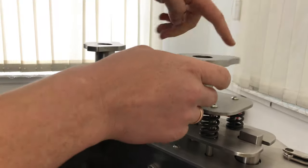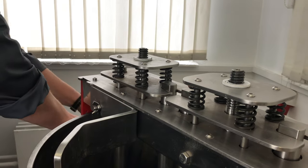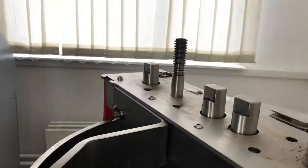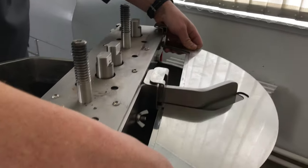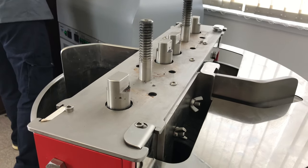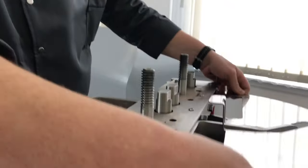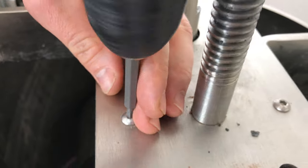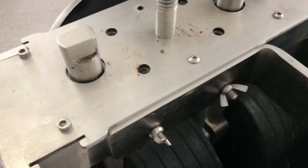First you need to release these parts, remove these parts. One more important thing, after this the chocolate heated to 87 degrees, and sugar and milk caramelized, so this could be the reason for the bad noise from our melangeur. Okay, let me take this one. Just imagine that the pressure of the stones was enough to heat the choco mass up to 87 degrees without any compressed air. Only stones, 87 degrees.